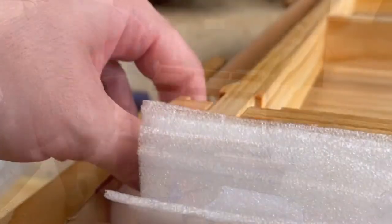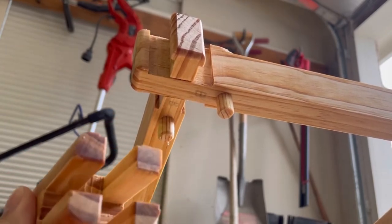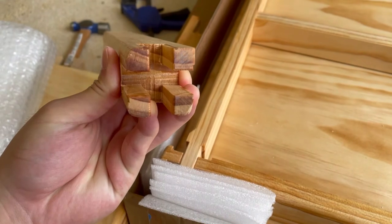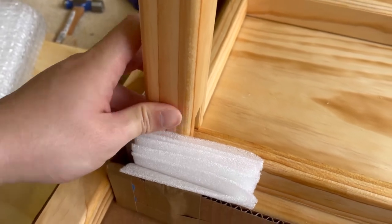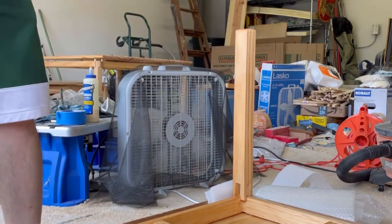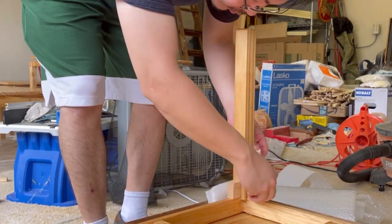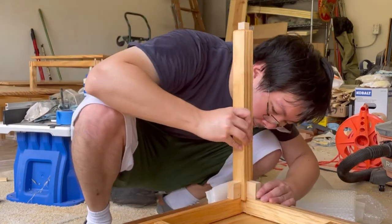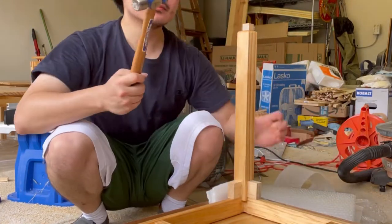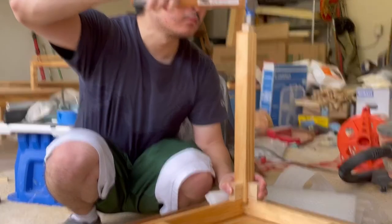Now, carefully lift up one of the corners to see which letter it is labeled as. Find the leg labeled with the same letter. Note that the corner on the leg where the letter is should also be square, whereas the other corner should be rounded. This square corner with the letter should go on the inward facing corner of the table. Put the leg in place. Now we need our aids. Take the three aids and place the two 90-degree blocks against the beam and the leg. This will help guide the leg down straight, so that the table does not end up with crooked legs. Place the small block of wood labeled with an X onto the end of the leg with the X facing up. This will be where the hammer will hit. By using this aid, we avoid denting the leg when hitting it with a hammer.